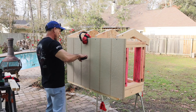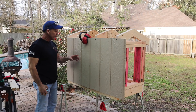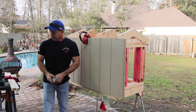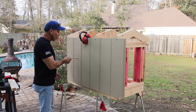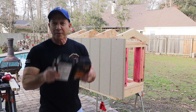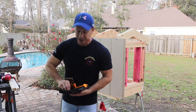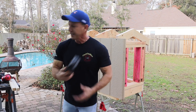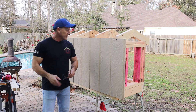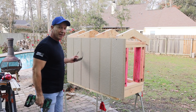You get your measurement from the inside to your door, which is right at twelve and a half inches. Try to get close to your frame; if you're a little on the inside that's fine. You want to save that cutout if this is an actual door opening, because I use that to make my doors. Now I'm going to drill a hole right through this and we'll follow it around. This is a Harbor Freight warrior bit set and it is junk — you have a hard time cutting balsa wood with these. You can get a Skill set for about the same price, around $19. Get yourself a good bit, because the drill is plenty powerful enough, but a dull bit is the problem.